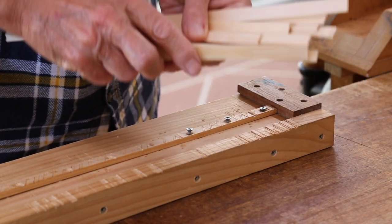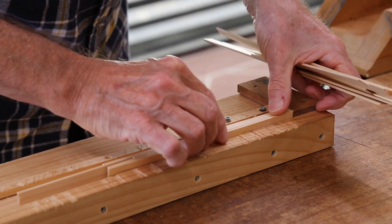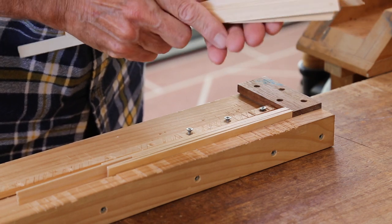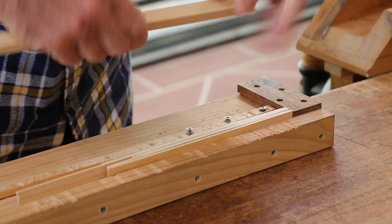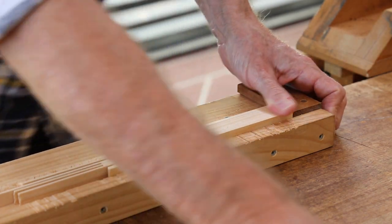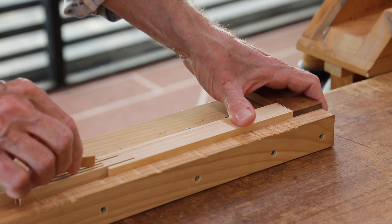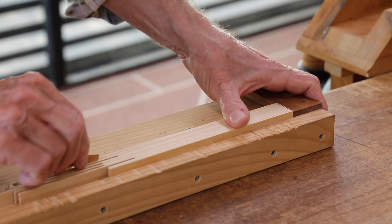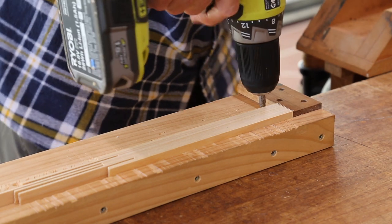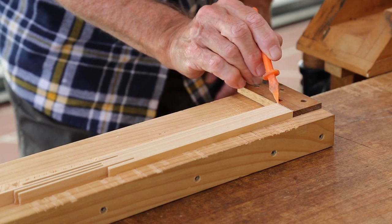When all 12 pieces have been trimmed, secure them in the 90 degree kumiko cutting jig with the trimmed ends against the end stop. The angles should all face the same way. In Book 3, I have the 15 degree angle facing the side support, but here it's the 45 degree angle. It doesn't matter as long as they all face the same way. And double check that the trimmed ends are firmly against the end stop.